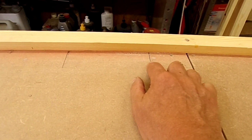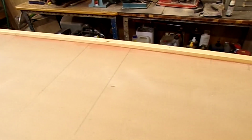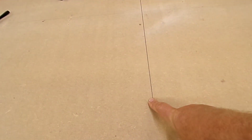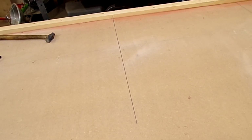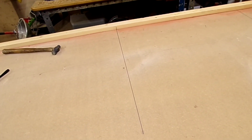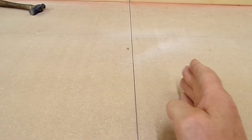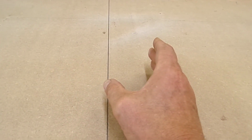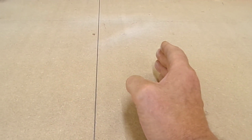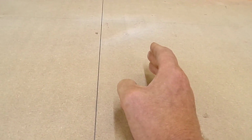That's a fixed position at the top here, but where it goes to at the bottom is determined by the rear spar carry through, as I said earlier. We've got these two are verticals, and this is the firewall one, which is vertical on the plan, or 90 degrees on the plan. I'm contemplating changing that. I'm going to be moving the firewall back a little bit because the engine I'm using has intakes running behind it, so I need to move this back to allow for the intakes and not have the engine going further forward, which would really affect the centre of gravity.